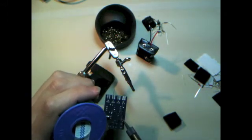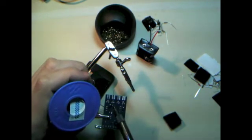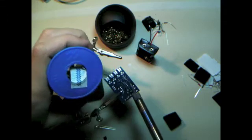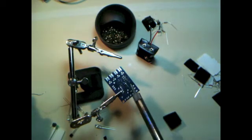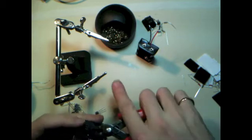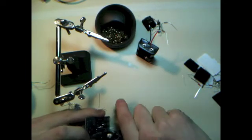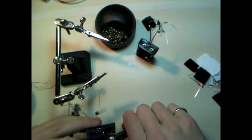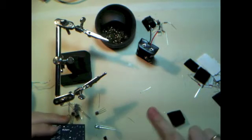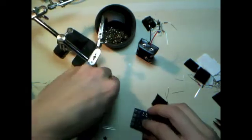If I was going to do this chip again, I would do all the lowest profile items first — the resistors would all go first, and then whatever was bigger than that, so probably the oscillator, then the transistors, then the mount for the IC. I just realized as I'm clipping these, I'm going to be mixing in all my garbage with my good parts. I need a little way to store them so they're covered and free of garbage, but I'd like to be able to reach for my new parts without letting go of what I'm doing. So a little door that opens automatically when I put my hand near it would be perfect — maybe I'll make that in an upcoming video.